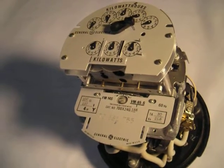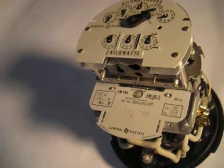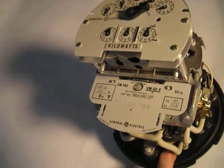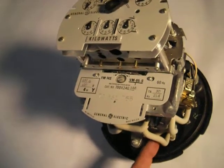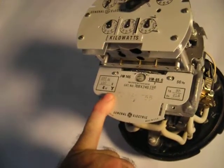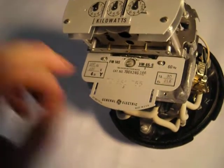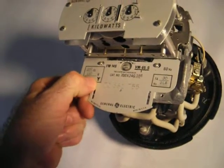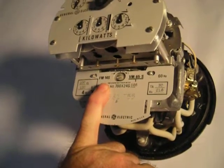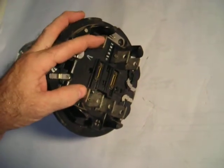This is a General Electric VM65S three-phase wattmeter, 200 class, which means it's 200 amps full load. It doesn't have external transformers — the shunts are down inside. It's for four-wire, three-phase Y, which could be like 208 three-phase where the center of the Y is grounded. This is a Form 14S type meter that has seven prongs in the back and uses a special meter base.